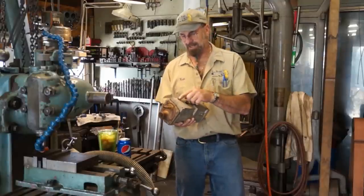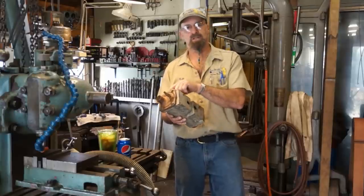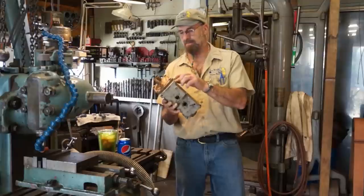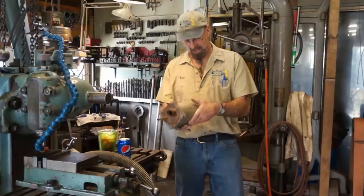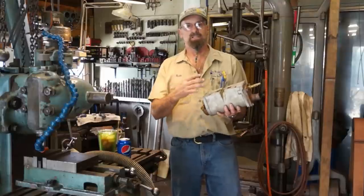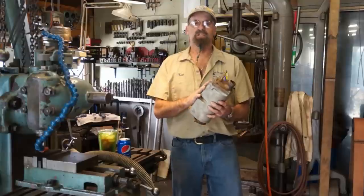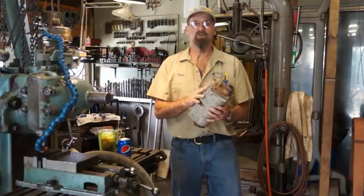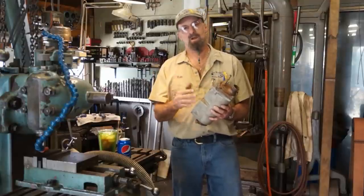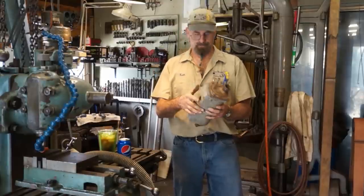And he has one issue right here with the screw being broken here. And there's a lot of corrosion and material lost around the aluminum casting on this flange here. He thought it would be best to have me finish dismantling and get the core out. He'll send the core out and get it worked on. Then we're going to see if we can do some buildup, some machining, some repair on this aluminum housing instead of having to buy a new one.